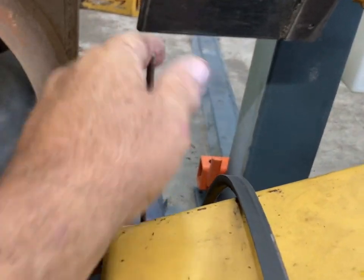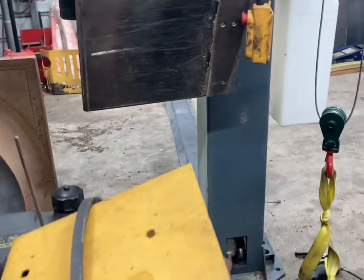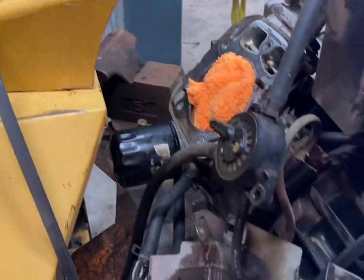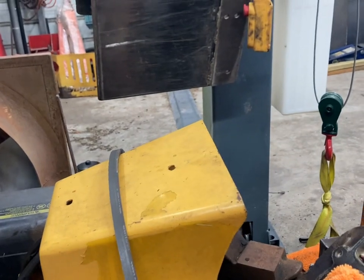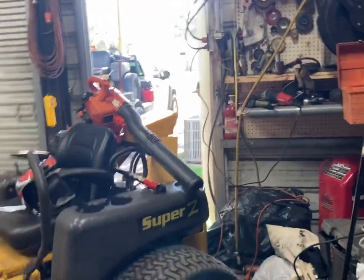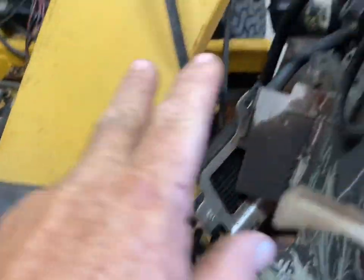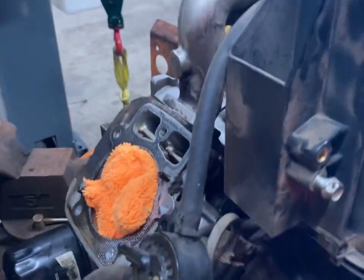That's the normal stuff. And if that blower got snagged on a tree branch or something, the pin would give way and the blower would fall off. So that's the bad thing about not being organized. This mower's down — it's needing a new push rod and gaskets, and I'm waiting on parts.